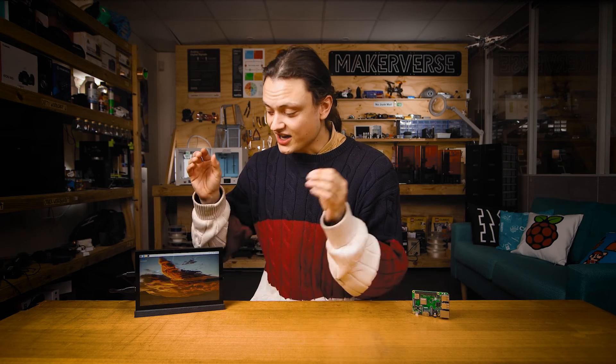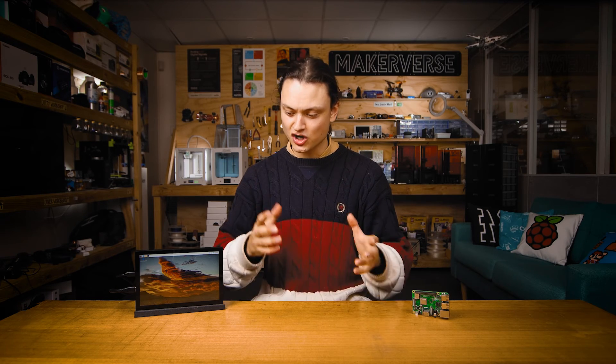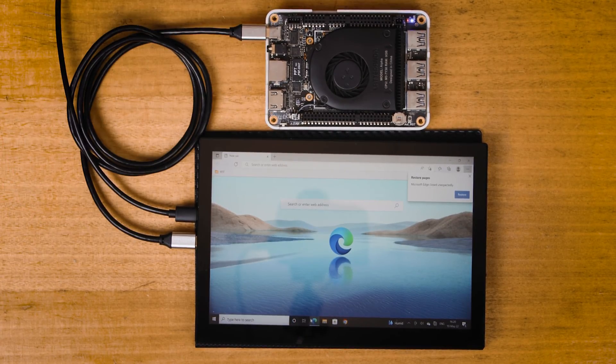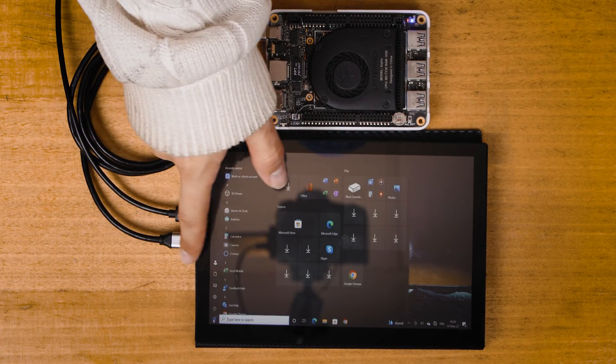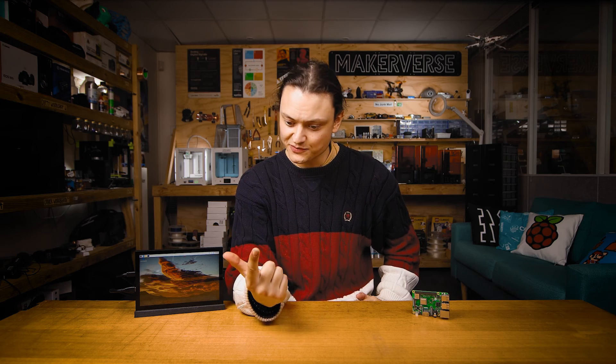These screens also have a hidden extra feature that can't be demonstrated with a Raspberry Pi: USB-C power pass-through. Two USB-PD enabled devices negotiate a power contract — a handshake — when plugged into each other, and this also enables touch and display data to be sent through the same USB-C connection. This is shown perfectly using a LattePanda Alpha single board computer with the DF Robot display, which has full touch compatibility and runs full HD video smoothly while being powered through the screen via a single USB-C cord handling touch, display, and power.